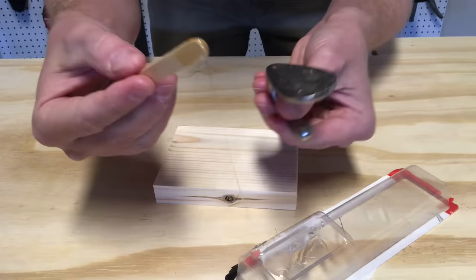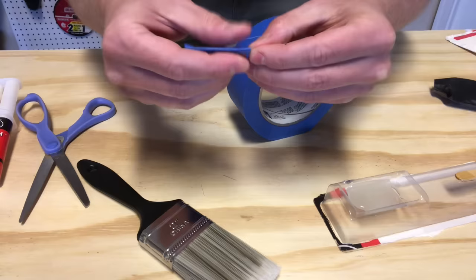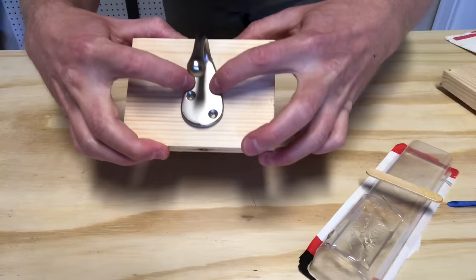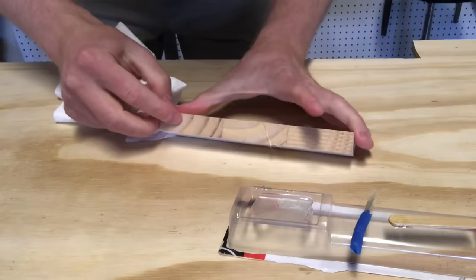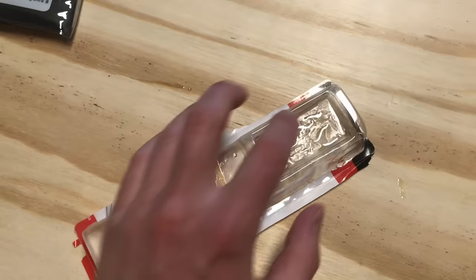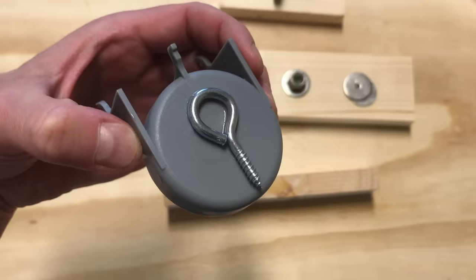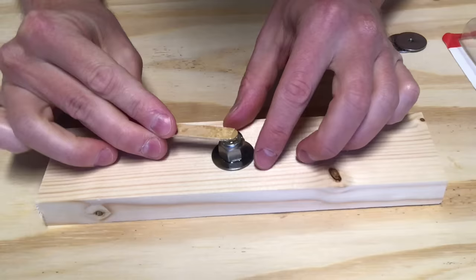Don't touch the epoxy — you probably want to wear gloves and goggles. Use another piece of scrap to trowel it into the area you're fixing or attaching. I sometimes use paintbrush bristles taped together; I really like that approach because it lets you brush the epoxy on evenly. When you have a good layer on, just press your pieces together and ideally supply some pressure — with finger pressure or a clamp if you can work one in. You even have some working time to wipe the squeeze-out away with a paper towel. Temperature can affect bond time, but typically 5 minutes is all it takes for a 5-minute epoxy. I like to test this by checking my leftover epoxy in the mixing tray — if it's hard, I know the epoxy in the repair probably is too. It's bonded. It'll take many hours to fully cure, so you don't want to stress it, but it's already way stronger than most other adhesives will get it.